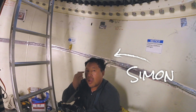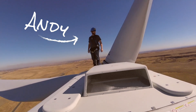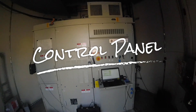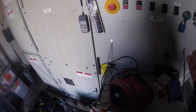This is Simon and Andy. We're getting ready to lock out the GE and go reset power to the LiDAR. Just going outside to make sure we are pointed in the right direction for nacelle entry, giving the turbine a stop command, and we will lock out all operations for the wind turbine before we go up.